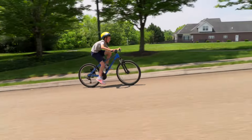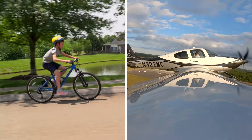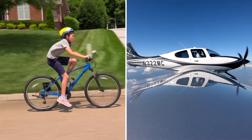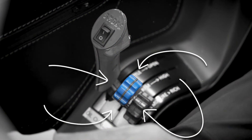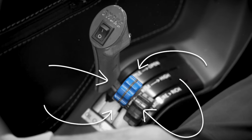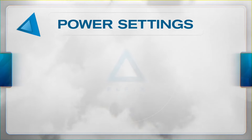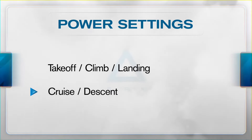The point of such a system is to maximize propeller efficiency as it relates to changes in airspeed across various phases of flight — setting a lower blade angle at higher RPM for climbs where you need aggressive thrust, and increasing the blade angle to cause a more streamlined, lower RPM, allowing the prop to bite into more air for high-speed, lower-drag cruise phases. In most airplanes, the pilot controls blade angle manually with that blue-handled prop lever between the throttle and mixture controls. If you've flown an airplane with a prop lever, you'll know it's usually bouncing between essentially just two positions, tailored for takeoff/climb and cruise/descent phases.